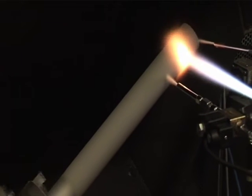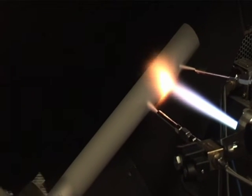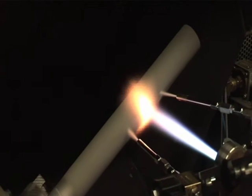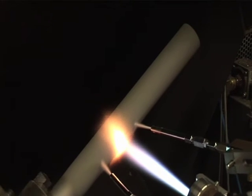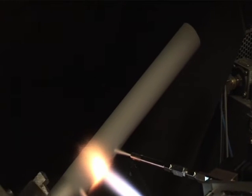The liquid CO2 expands in the nozzle and a CO2 snow and gas mixture result, which yields an optimum cooling capacity at minus 76 degrees Celsius. In addition to cooling, the cleaning effect of the snow particles also produces a surface which is free of dust and metal particles.